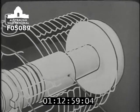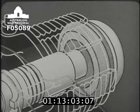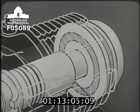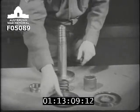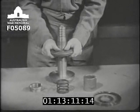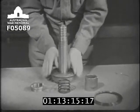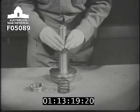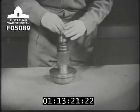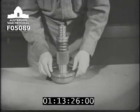Between the front of the breech screw and the mushroom head is the obturating pad, protected by its disc and rings. Watch how all the parts fit onto the vent axial. The front ring, the obturating pad, the rear inner and outer rings, the sleeve, the spring, and the nut which screws over the vent axial and holds the spring in place.